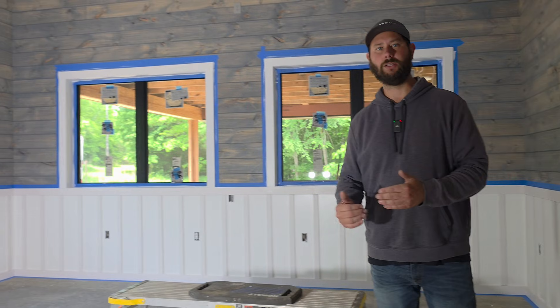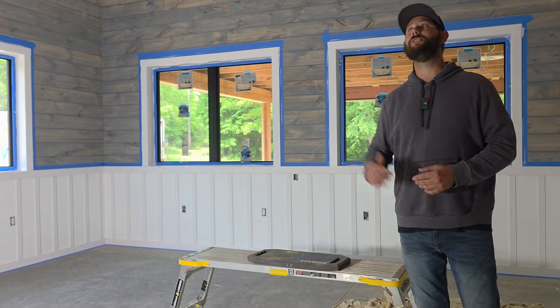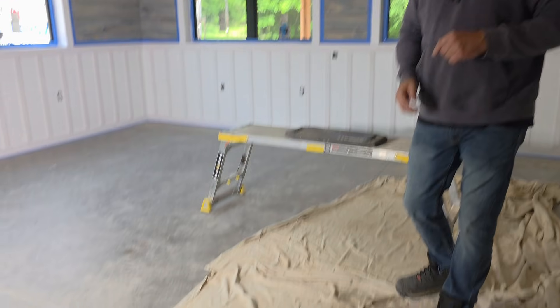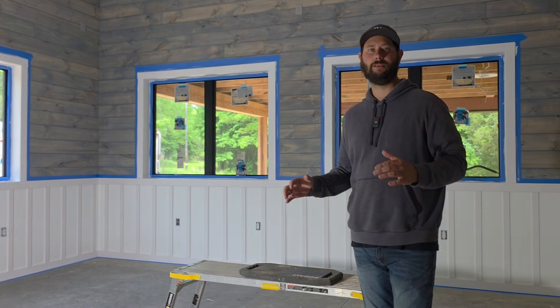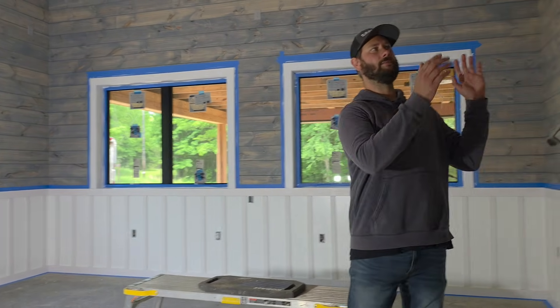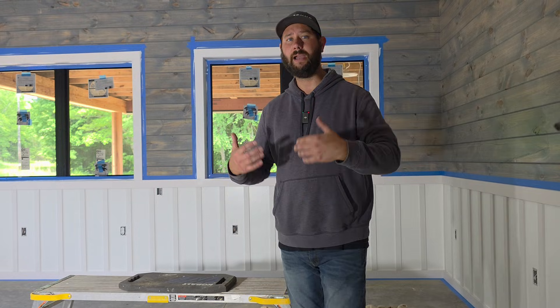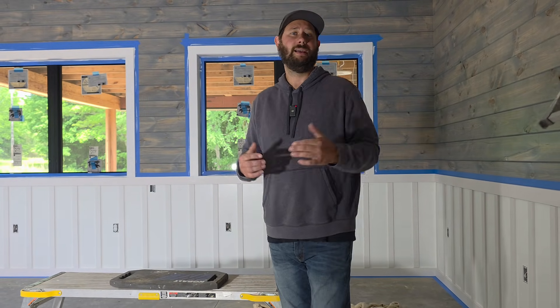If the doors are going to stay closed and we can't undercut them or add a grille or fan, that room will be sealed up tight. We can always add a smaller mini split in there later — at less than $5,000, our total investment is still less than having two conventional units. Plus mini splits are super efficient, so the monthly electric bill will be very affordable compared to two larger conventional units with higher energy consumption and mechanical space requirements.